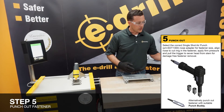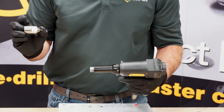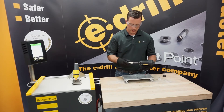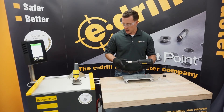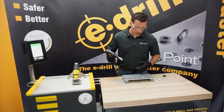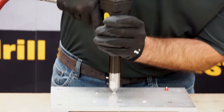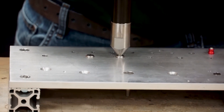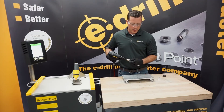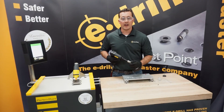Next step is to remove the fastener. We're going to use our single shot air punch. I've got a dash-eight nose piece — I'm going to thread it on nice and snug and then connect my airline. When using the single shot air punch, it's very important to make sure before you pull the trigger that you are in fact down inside the cut groove we just made. Apply a steady amount of pressure, squeeze the trigger one time, and the head fractures from the shank. That is protruding head removal.